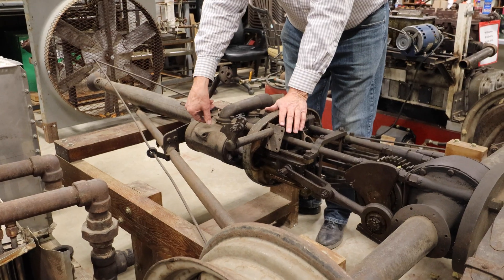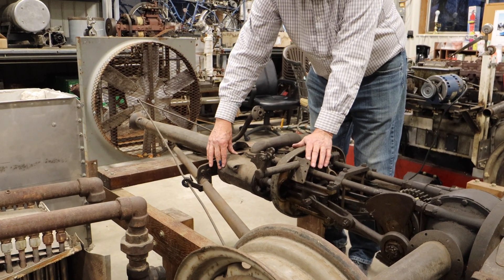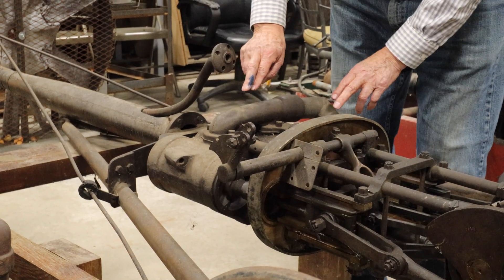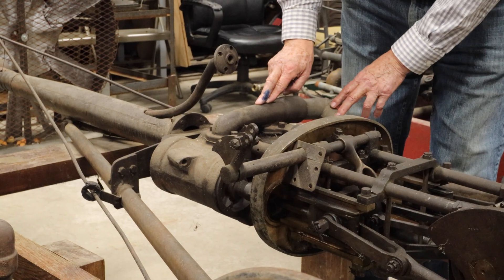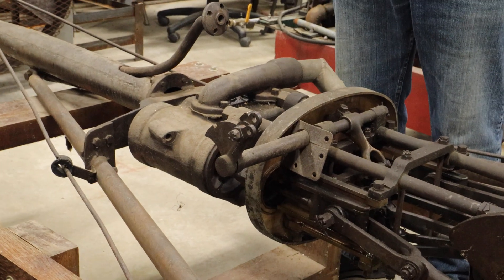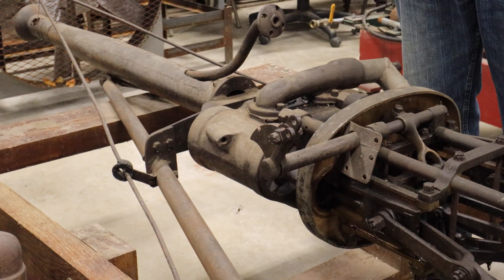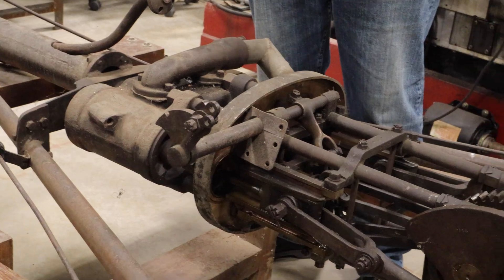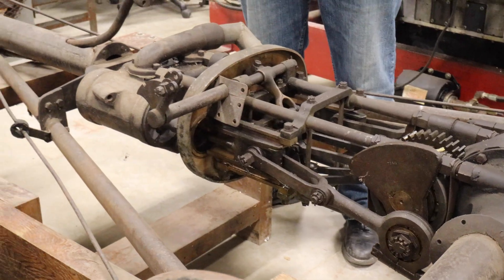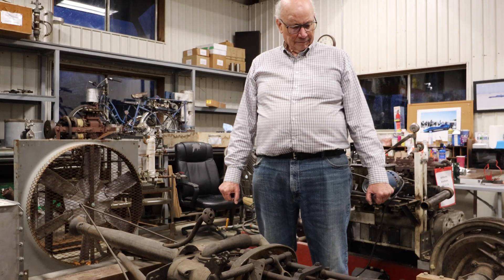There are very thin double-acting pistons in here that go back and forth. These are cylinders; this is called the steam chest that's in the middle. The exhaust comes out here and the steam goes in right here — there's a pipe that puts the steam in there. There are various openings in the castings which prevent the incoming steam and the outgoing steam from getting mixed up, except for heat leaking out all over the place.